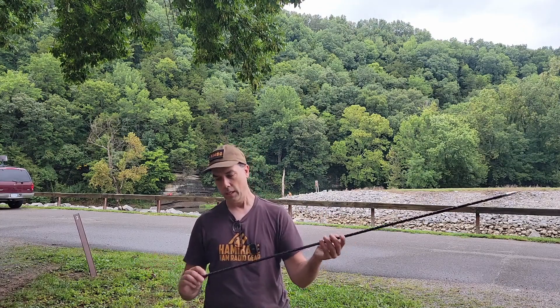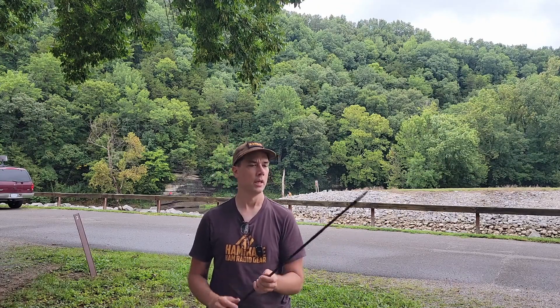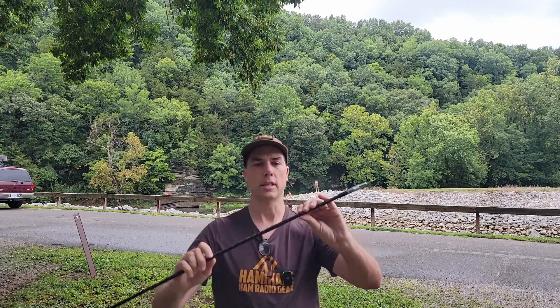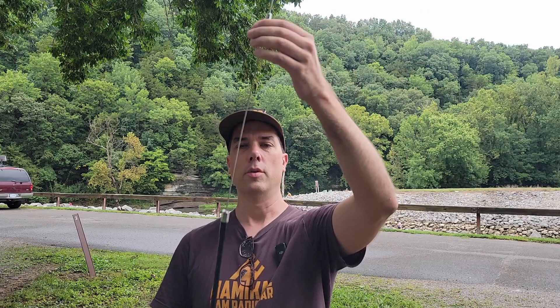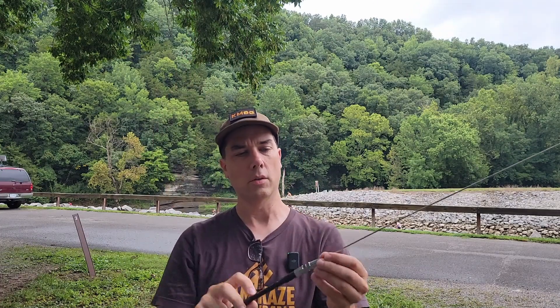When you look at it, this black part on the bottom is wrapped with a wire. I wonder what that's doing. When you get closer to the top, you'll see that the windings get a little tighter. So we have loose windings, tight windings, and then looser windings. At the top of the antenna, you'll have this metal whip, which you can use to make the antenna itself resonant. When you get this thing shipped to you in the mail, it comes in two pieces — the whip goes inside the top section, then this screws down nice and tight. Once you get it adjusted, you lock down those two screws right there. It does come with the Allen wrench.